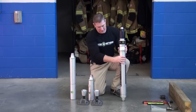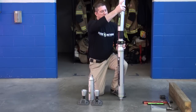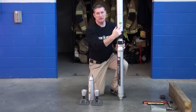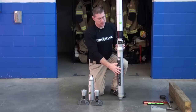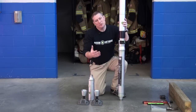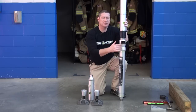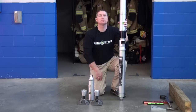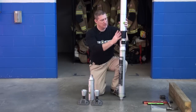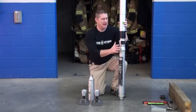You want to ensure that you've got lots of playroom within your strut lengths when assembling them. So we know that desired length and what parts and pieces we're going to utilize, so we're going to go ahead and assemble this strut and extension mechanism. Once we've got it in place, the green detent button comes out. Now I have my strut and extension assembled, and I'm going to work on my base plates. It's a little easier to pre-assemble base plates to the headers and soles rather than placing them on the strut system and then trying to nail your headers and soles onto it.